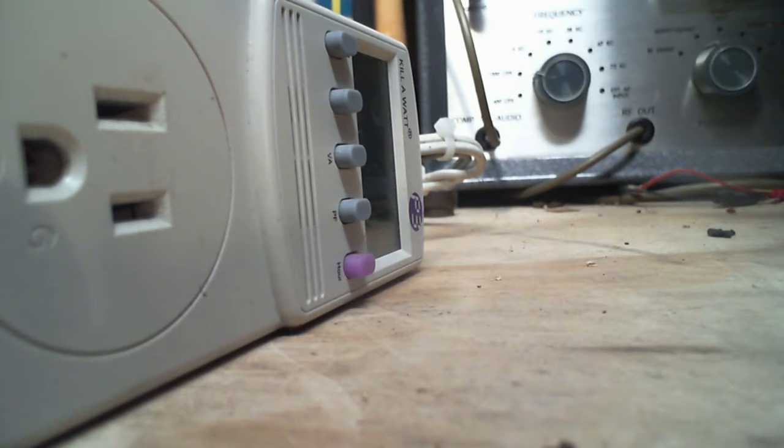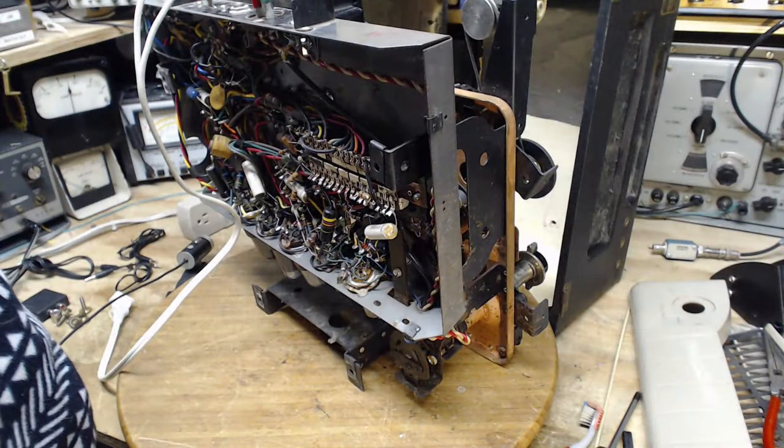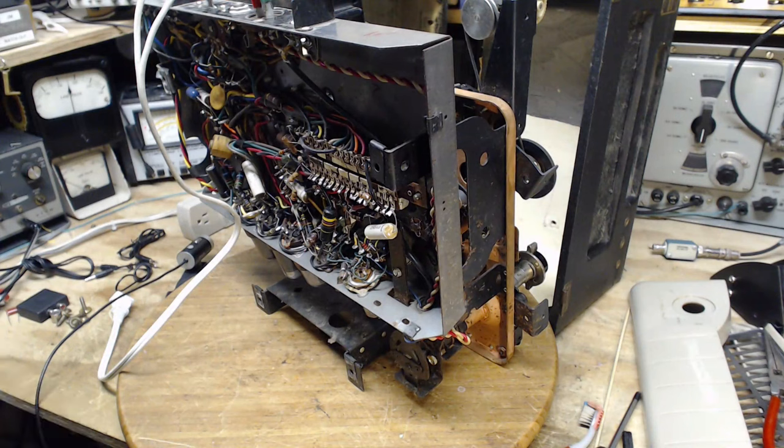This yellow one is coming from the motor and this red one here is coming from the motor. Why would they be a yellow and a red — yellow and red? To spin the motor in different directions. So if I've figured everything out, there should be motor voltage right here. If there's motor voltage here then there's motor voltage on the wires coming into the motor and the motor is not turning. That will be the end of that — this might be a short video.